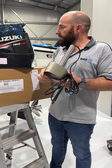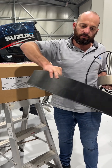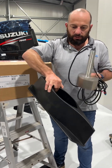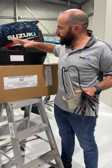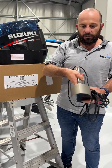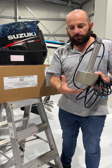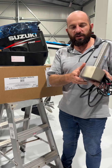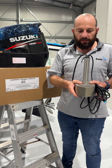This model comes with a big fairing designed for your larger flybridge style boats. These are cut to suit the deadrise and the transducer is installed inside that pocket. They can also be purchased without the fairing to suit a pocket mount style for trailer boats, so these can be keel mounted with shipwrights building a nice hydrodynamic teardrop fairing around it, sitting dead center of the keel covering that 120 degree beam width.